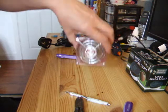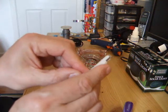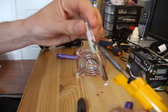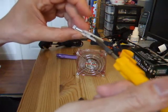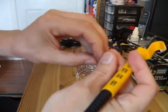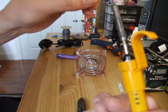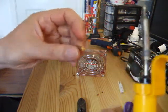The soldering iron's heated up. Got my little fan to blow away the fumes. Take that bit off there — wire there, wire there, soldering iron. That side's loose, that's loose, and that just slides out nicely. And there we are — vibrating motor. Just tidy up the solder on the ends a bit. OK, that's that bit done.